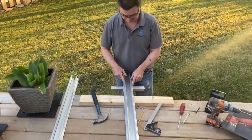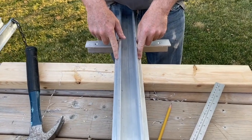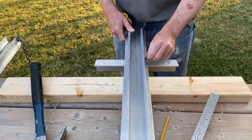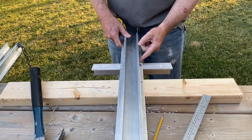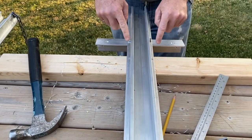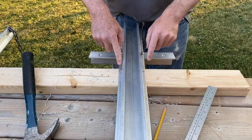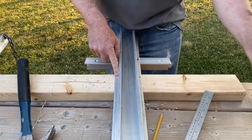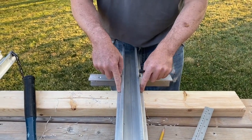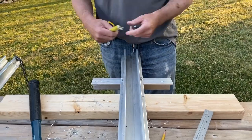Let me bring it up a little closer so folks understand what I mean about the center. It's very important that you mount these in the center of the flange. If you don't, these nuts will jam and interfere and you won't get it mounted. Measure twice, drill once. Use the center punch to mark it nicely. Use the 1/8-inch pilot hole to get it nicely centered, then follow up with your quarter-inch and it'll be perfect.